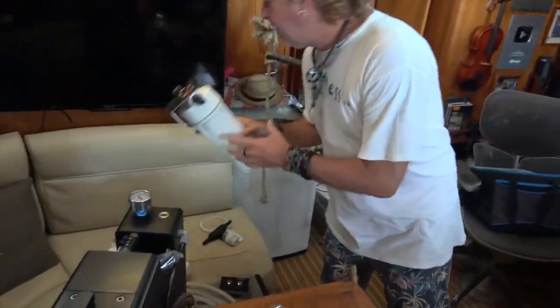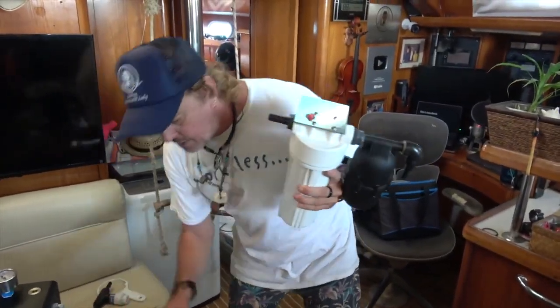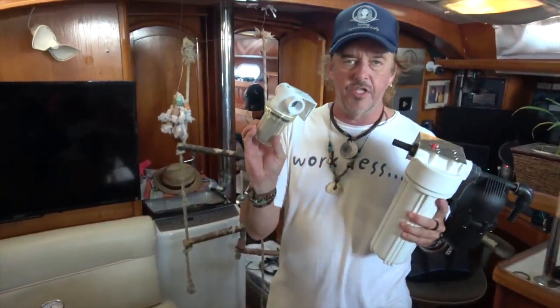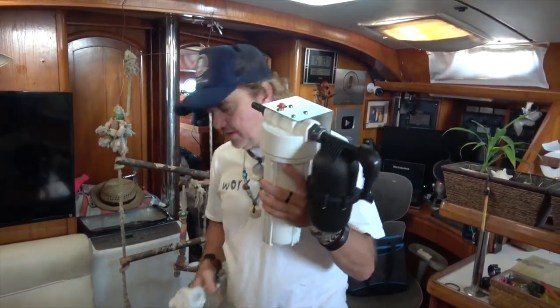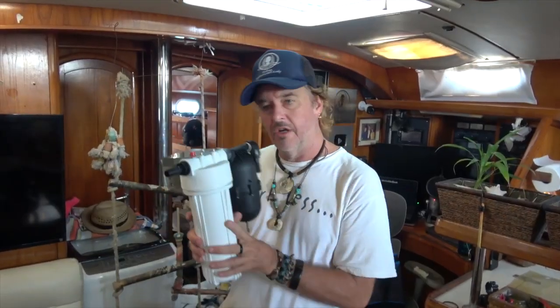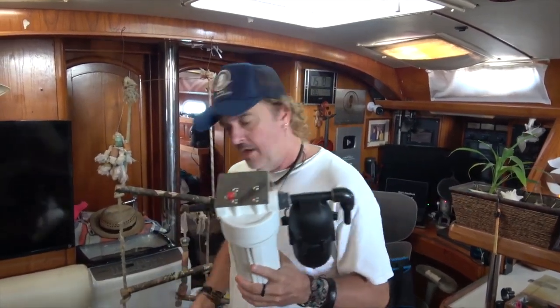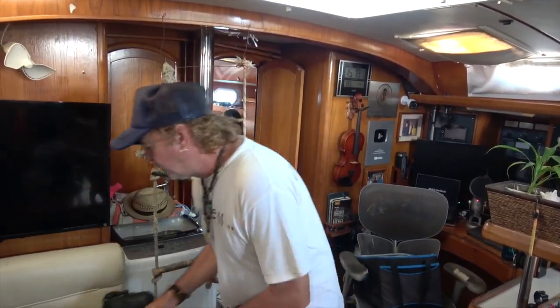The sub-components include the pre-filtration as the water comes into the device. This is the main seawater filter right here — it has a pre-filter which is more of a strainer, just for removing debris from the ocean water coming in. From there it goes into a unit with a small accumulator tank, through a five micron sediment filter. You never know how long the filters are going to last — that completely depends on the water you're treating, so always keep lots of spares.